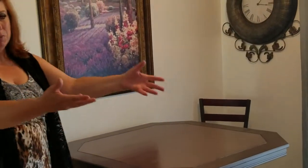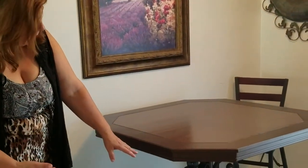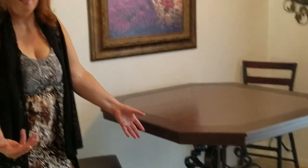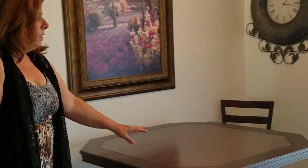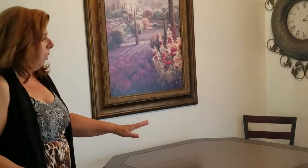This table was just picked up — someone was throwing it away. The black cast iron was a bit rusted, and Rust-Oleum takes care of that after sanding it out. The water-based varathane is used on each and every coat, and my top coat was an oil-modified varathane for longevity. It requires a minimum 72-hour cure.